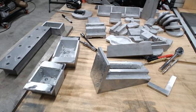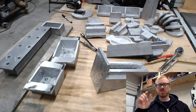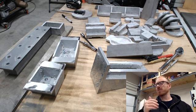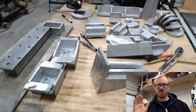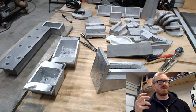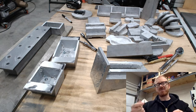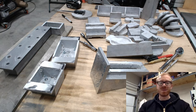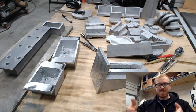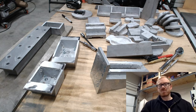Yeah, I feel like with the smaller 1-inch belt sander that I have, I can kind of tune in, almost like scraping. You just focus on the areas that you want to reduce, and the other parts you can kind of leave alone. But with the 12-inch disc, if you're trying to remove material in the middle, there's really no way to do it. And if it gets cockeyed at all, it's going to round over the corner. So that's kind of what I was fighting against.